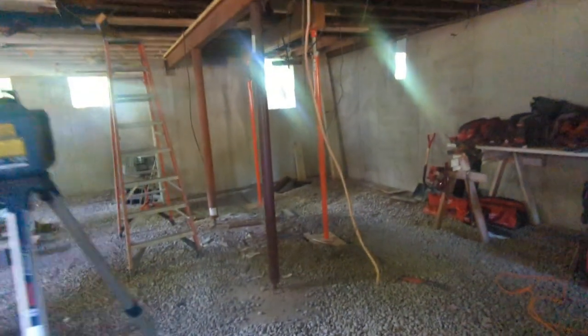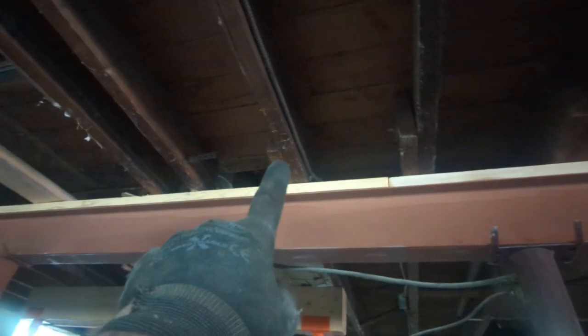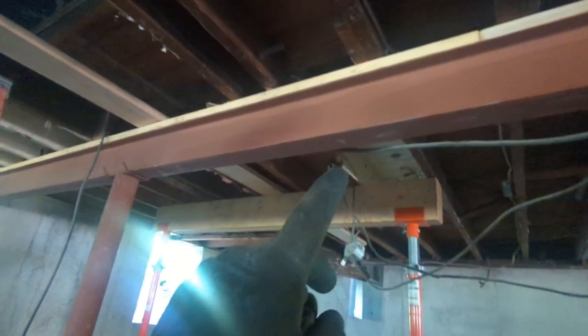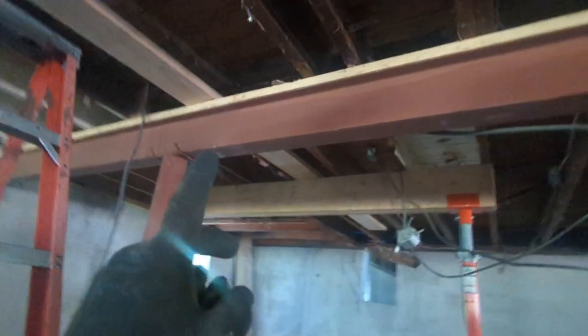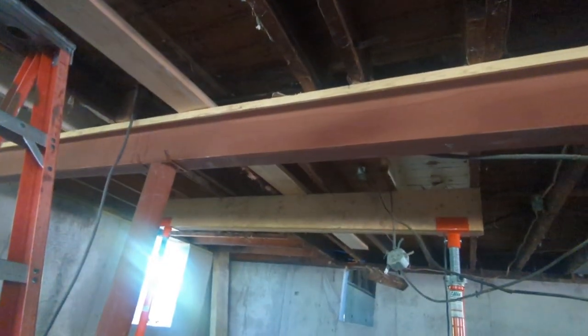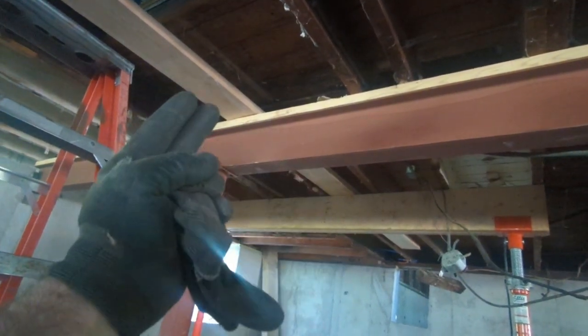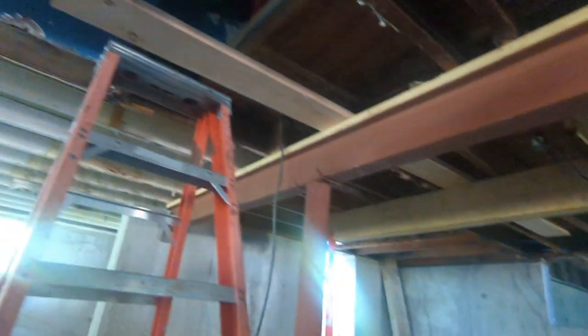Okay, so new day, went and got some lumber, work car. Got a 12 up in here already. Like I said, those are the ends of the joists that are complete coming from the far side. And on our side of the house, they're on the right-hand side here. And so, figure, sistering on our side of those over there puts the new piece on the same layout that this side of the house is on. It's just a best practice.